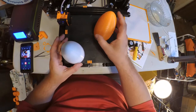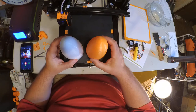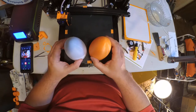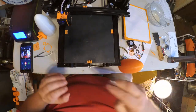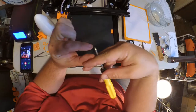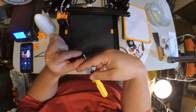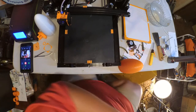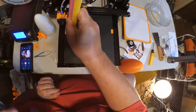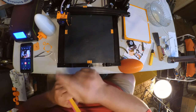So you have to decide, can I place these two objects here? Okay, but what if I do want to do this, and I want to put six nose cones on this bed? Well, I can do that. If this is the print nozzle, and this is the shroud surrounding the print nozzle, I have that much vertical space. So I can print that many layers before I'll have a nozzle collision. So I have to actually come in here with a ruler and measure how far from the tip of my nozzle to the nearest obstruction that might collide. And now I can tell Simplify 3D, okay, do a sequential print.